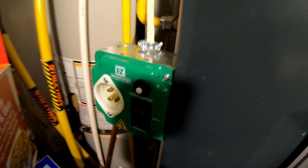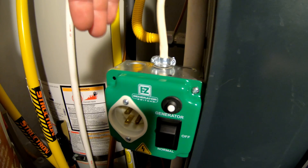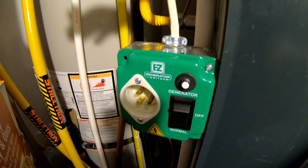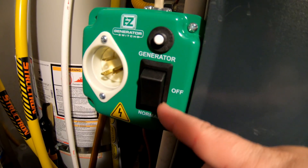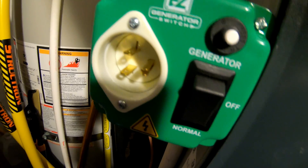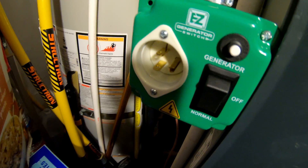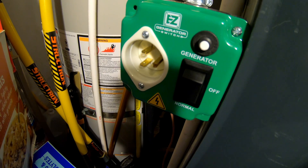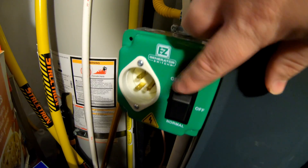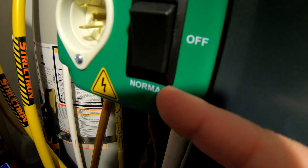Let me show you how this switch works — it's super easy. I'm not going to detail how you wire it because there are a couple of different ways: you wire it one way if your generator or power station has a floating neutral, and a different way if your generator is grounded at the generator. It's just a switch, and notice the outlet right here with prongs so the female end of the cord can attach. Those prongs are never hot unless the cord is plugged in, and they're not accessible when it's plugged in — so very safe. There's a little resettable protection device right here, which is great, and then just this toggle switch.